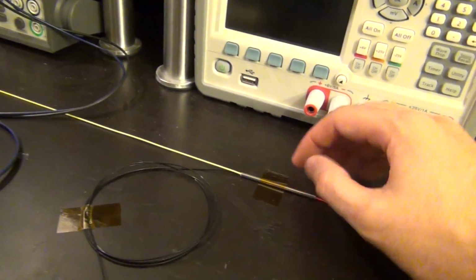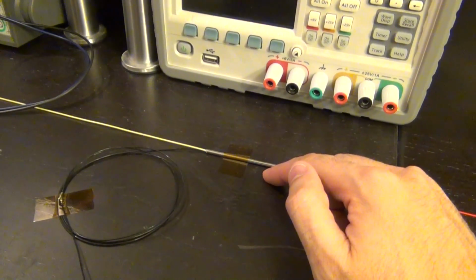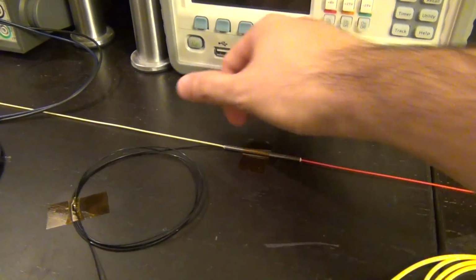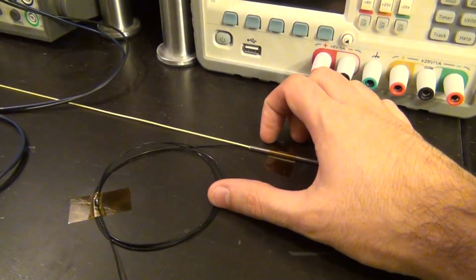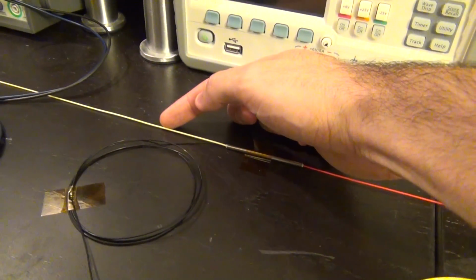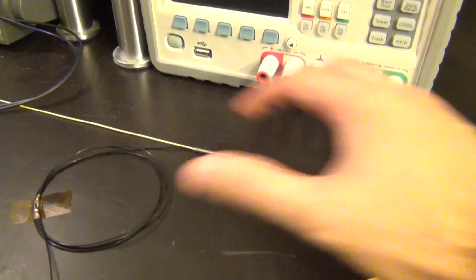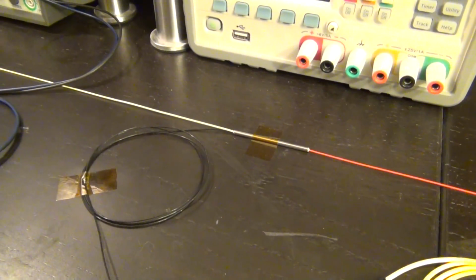If I follow this little cable, it reaches this little part. This is an optical coupler, a 10-to-1 optical coupler. For all practical purposes, because 10-to-1 is quite a large ratio, you can think of it such that this yellow fiber puts out 10 dBm less power than this black fiber. So if I put in 0 dBm in here, what comes out of here is going to be minus 10 dBm, and what comes out of here is going to be roughly 0 dBm. It's similar to an electronic coupler, where you can have a 20-30 dB coupler. This is just an optical version of the same thing.